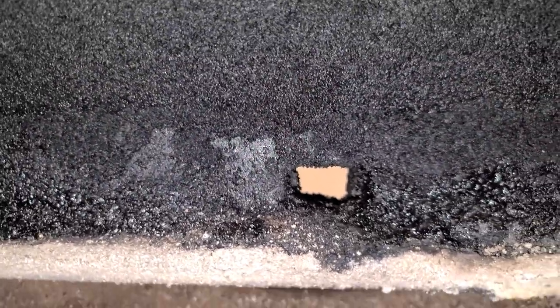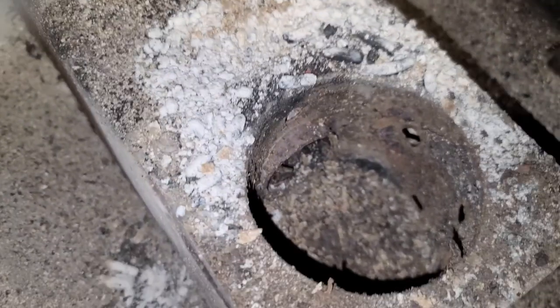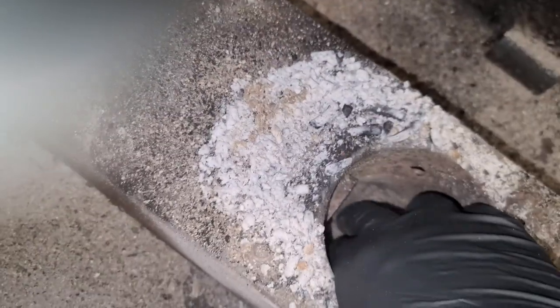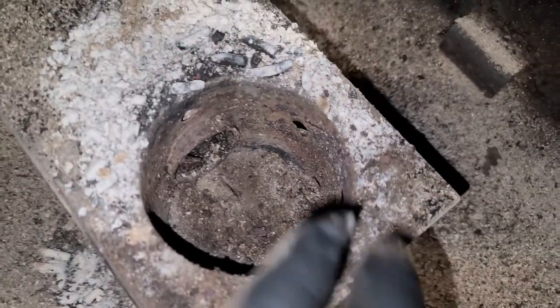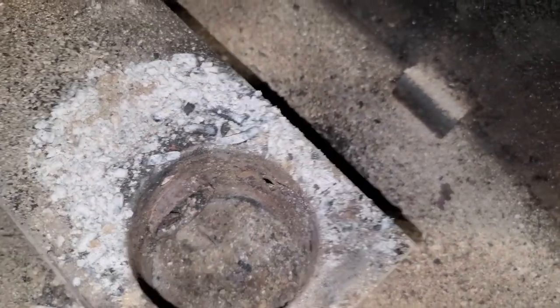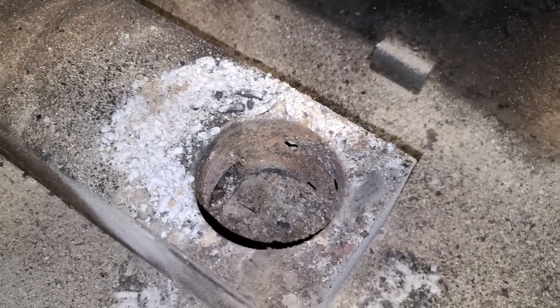I'm going to clean out my chimney a little bit and my drain hole — look how full that is. I definitely got to clean that out; that could be part of it. You've got to have airflow with your chimney and that hole down there, otherwise it will start sucking the smoke back down through the auger and back out your hopper. So I'm going to go ahead and look at the heat rod right here and take a look and see.